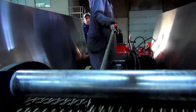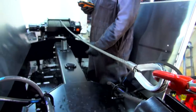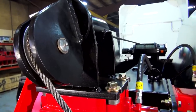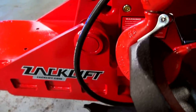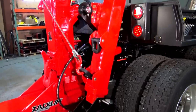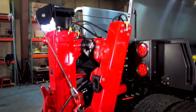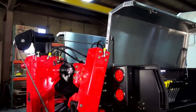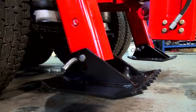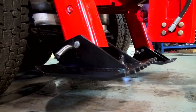This customer has chosen the additional option of a 30,000-pound winch. The winch itself comes spooled with half-inch cable, 200 feet long. Now that we have everything hooked up, we're doing a basic function test with the ZAK-Lift. At this point you'll want to inspect for hydraulic leaks to make sure all your fittings are tight. On our function test, we just make sure the ZAK-Lift goes through its full motion.